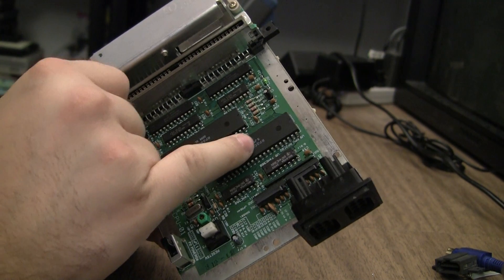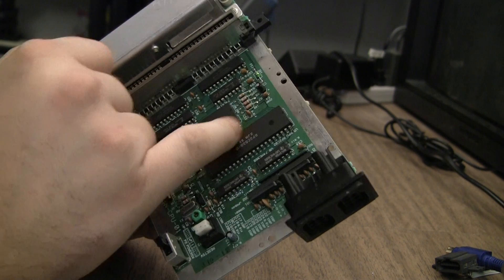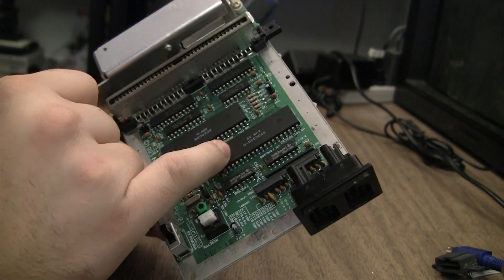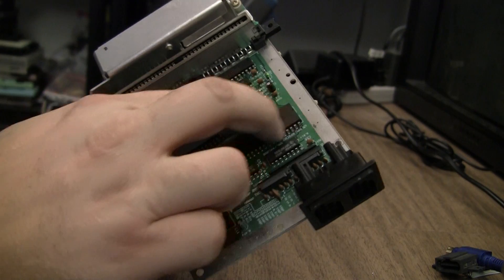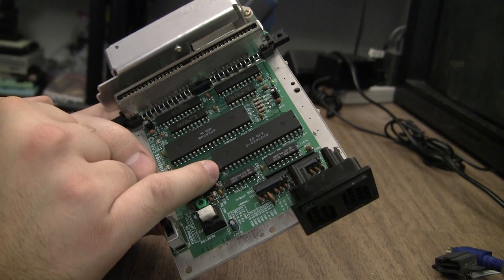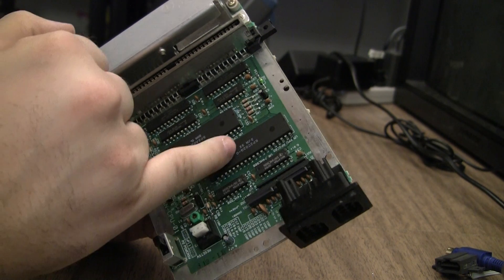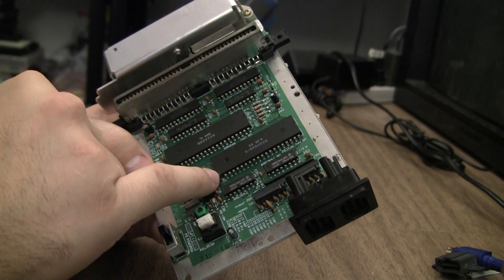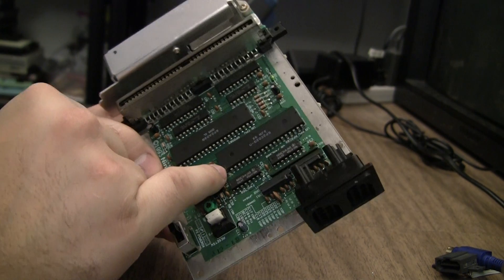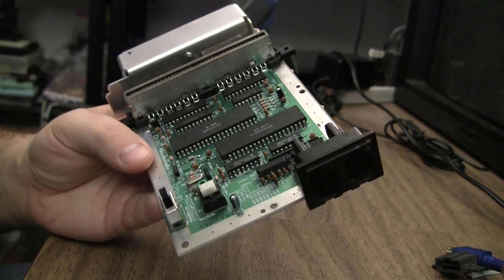That metal goes all the way up towards the center of the chip — only the center has the actual circuitry. It's usually just a matter of spreading out into a DIP format, so you actually have a metal leg going almost halfway up that chip. So we still have metal leg under that plastic — if we just chip away at it we can uncover some and hopefully have something to solder to without replacing the whole chip.